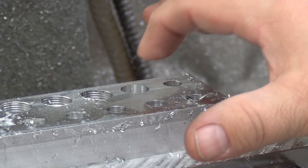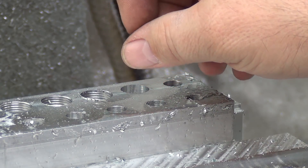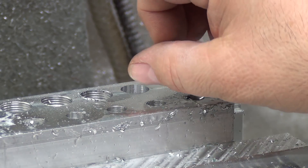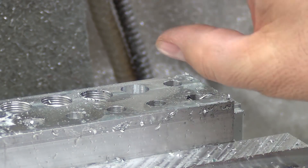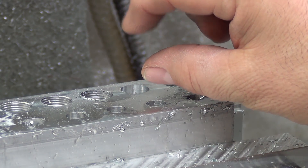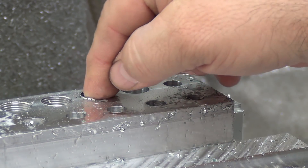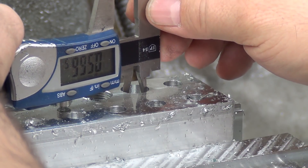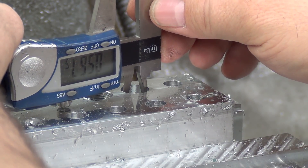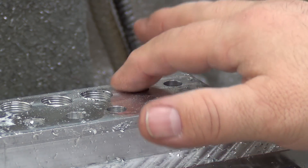I put in the correct thread pitch. When I put the rod end down in with the Sharpie marks on it, the marking was on the bottom of one thread pitch and on the top of another — that tells me that at some point it's binding in the thread pitch, not because it's too tight or loose. It was really way too loose at the top, so I changed up the stock to leave a little bit. Now this is back down to 0.05667, and I got rid of the stock to leave on that.